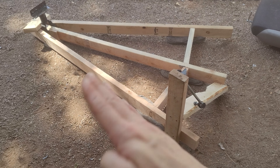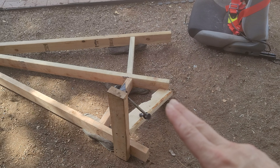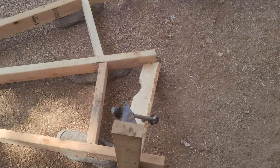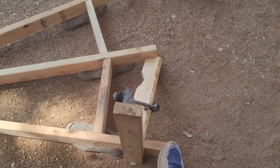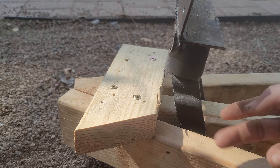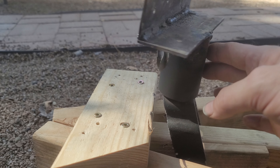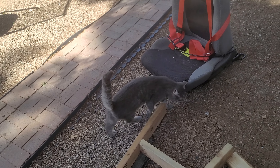Then I've got to rebuild the traction loss frame completely. Right now it's standing on its side — we're going to make all of it flat. I need to see where the old caster wheels' tracks are, and since we're moving them significantly further back, I need to make sure this is actually long enough for the new caster wheel position. We'll also be moving the u-joint pretty much all the way to the front and redoing it, making it significantly shorter if I can. I'm going to cut these off, make a flat plate I can screw into the wood, and see if I can shrink this down while still keeping the pivot. So that's got to be fully redesigned.